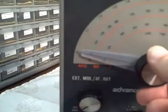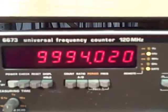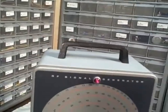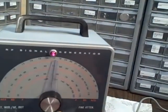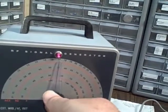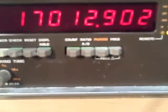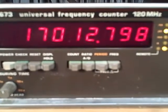Band E — we should be at 10 megacycles, and we are at 9994 kilocycles, so six kilocycles away from 10 megacycles — right on. Mid-band would be 1700 — that'd be 17 megacycles, which is 17,000 kilocycles — and we're reading 12 kilocycles high out of 17,000. Right on.